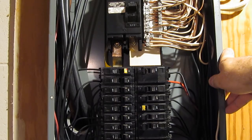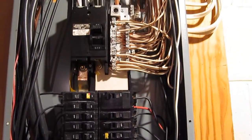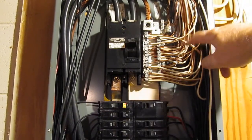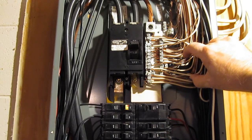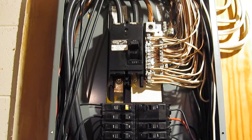All the test equipment was turned off at the time and was plugged into surge protection outlets, which were also all turned off. All the test equipment that was damaged is tied together through a GPIB cable, and the jacketing of that cable is a very heavy ground — there are two screws that hold each of those cables into the test equipment. So you would think the common mode voltage between all that equipment would be very low. They all share a common ground point. The grounds and the neutrals route together — the whites are neutral and the copper wires are ground, all tied to this common bus. I wonder if we just induced a transient between two of these ground wires, perhaps running up to two separate outlets in the lab, with enough current to yank those grounds apart. Maybe that's what actually caused the damage.